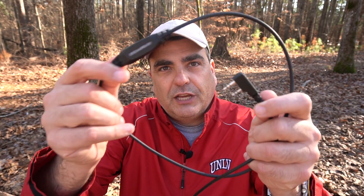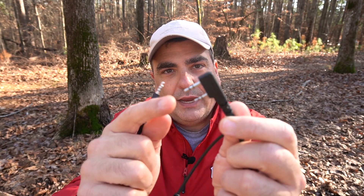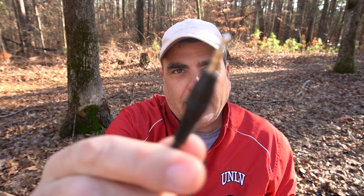So I'm going to tell you a little bit about the equipment I'm using today to capture APRS packets. I'm using my Baofeng UV5R dual band handheld radio, tuned to 144.390. I've got the diamond antenna attached. I'll put links to both of these down in the description so you can buy them — this antenna will receive a little bit better than the stock antenna. I'm going to be using my iPad and an APRS cable that has the Baofeng attachment on one side and a 3.5 millimeter audio plug on the other to plug into the iPad.